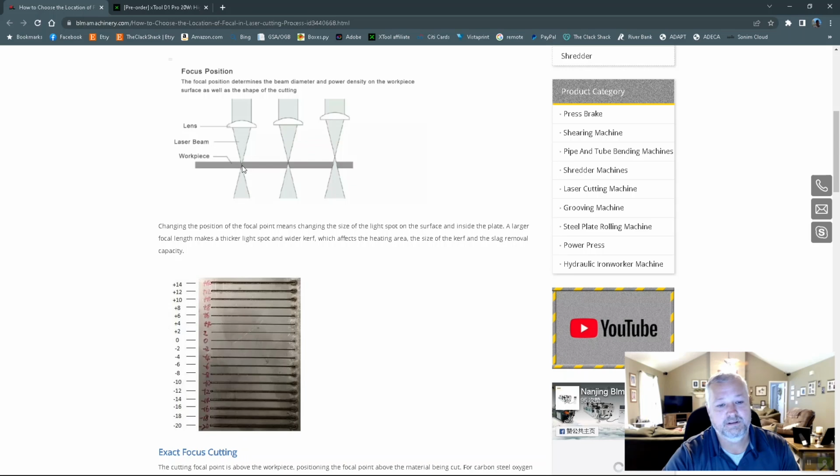If you look at the kerf here and the kerf there, that's what you want to do to minimize kerf on your laser. I hear a lot of people say, what's the kerf on a 20 watt? Well, the kerf of a 20 watt on a piece of 1/8 inch acrylic is significantly less than the kerf of a 20 watt on a 1/2 inch thick piece of acrylic.